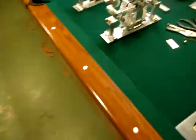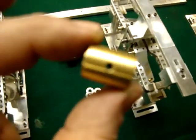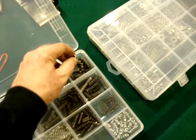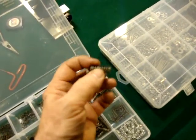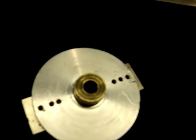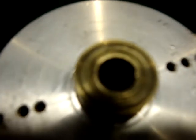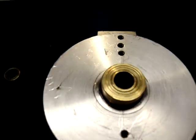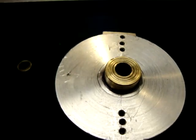I'm going to eliminate these bushings right here — I'm going to put something in that's a little better. I've got these springs that fit right where the bushings were, so it'll be tighter. There's a lot of drag — if you take a look at this, you can see the drag on there. When it runs around there it drags and you get little shavings. Take a look at this other side of the table — see how it's gouging, it's dragging, it's rubbing.